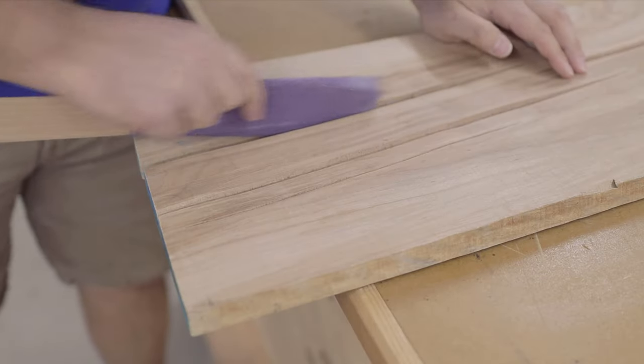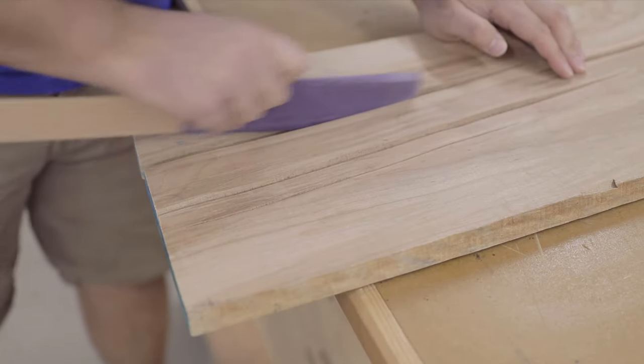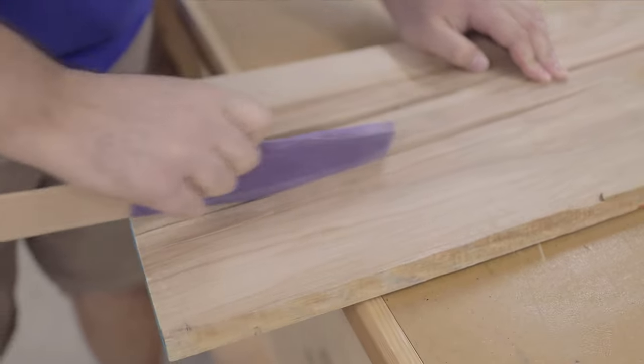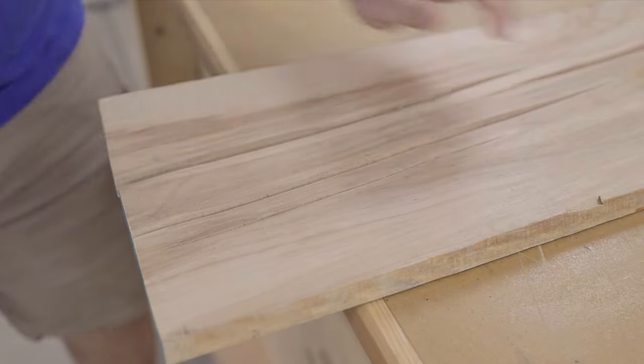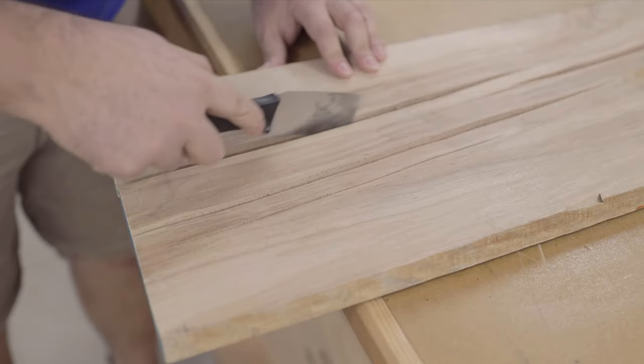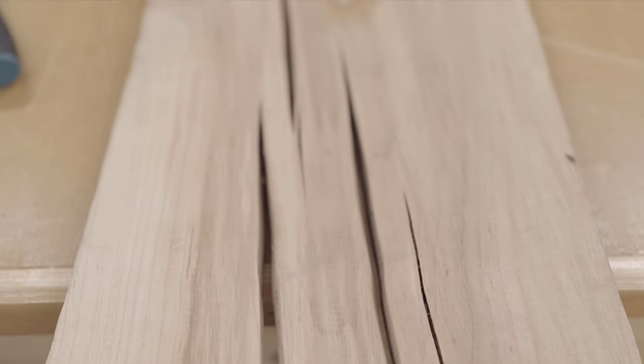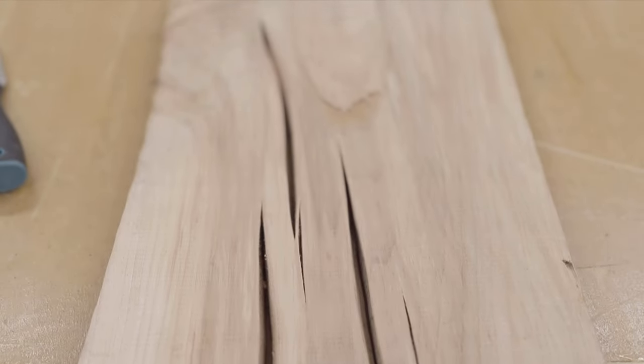The first thing you're going to want to do is take any bark off the piece. Epoxy won't really penetrate through that bark and it could fall off down the road. If there are any voids on the inside that have bark inclusions or anything left inside, you want to clean them out and smooth the inside as much as possible to give the epoxy a good surface to adhere to. I used a combination of sandpaper, putty knives, a scraper, and a utility knife. The utility knife was mostly used to cut open a couple of smaller voids that I wanted to fill with epoxy but that wouldn't have flowed down into the actual void.